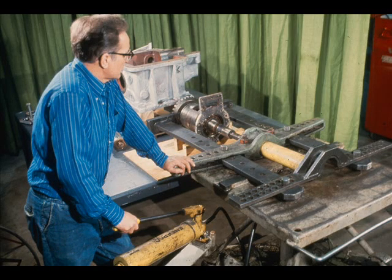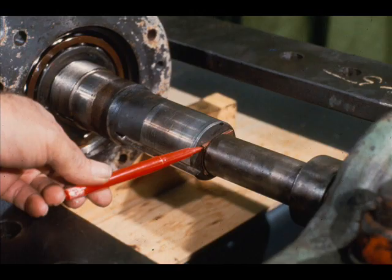We will use a hydraulic coupling puller to press the shaft and gear out of the cartridge. You may prefer an alternate method in common use at your plant. If you do press the shaft out of the cartridge, don't forget to protect the end of the shaft with a piece of copper, as being pointed out here. This will prevent damage to the shaft center.